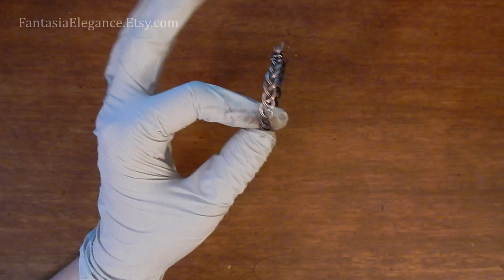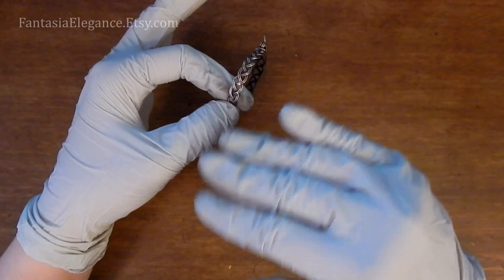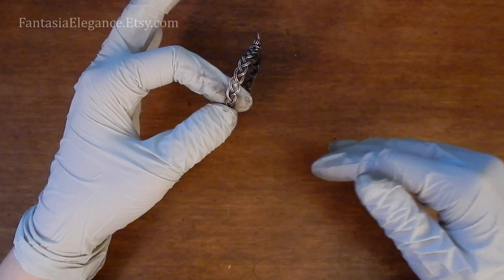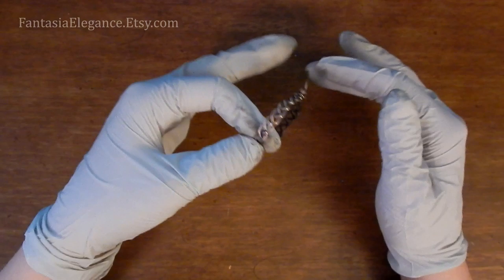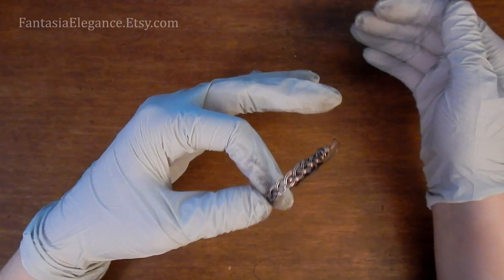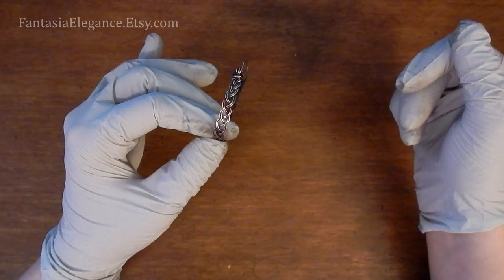For silver pieces that you've treated, I would recommend putting it in a bowl with a little bit of crumpled aluminum foil, sprinkling some baking soda on that, and then pouring hot near-boiling water on top. Let it sit for five to ten minutes, then pull it out with tongs so you don't burn yourself. The aluminum foil and baking soda will react to transfer the patina from your silver to the aluminum foil, so your silver will be shiny again. If you're curious about that process, I could make a tutorial — comment below if you'd like a video on that.